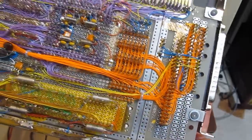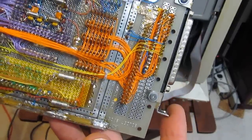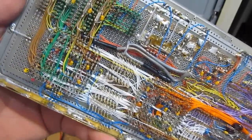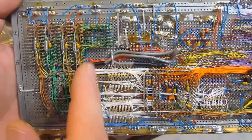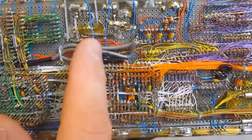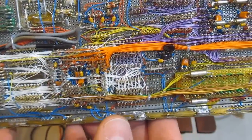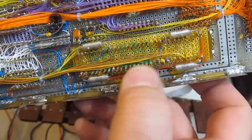On the bottom side of the board, it is all wire wrapped. You can see all the bypass caps — usually a large tantalum with a small ceramic. These sections of coax here are for the clock distribution, which routes up to the two larger FPGAs. This area here is the DRAM.